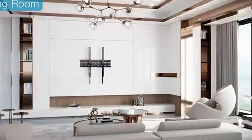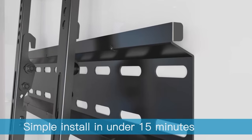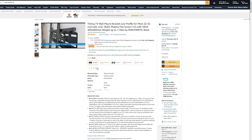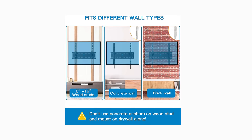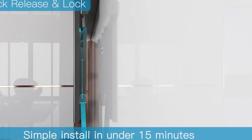You literally just screw the two brackets into the TV with the many sized bolts and screws offered inside the packaging, then slap the 16-inch plate up on the wall with the provided lag bolts and set the TV on top of the wall plate. It even has safety mechanisms to lock it in place and pull tabs to take those off later when needed. For pretty much anything 55 or 65 inches or smaller that you want a nice flat look on the wall, it's a fantastic mount. The only downside is that the mount is exactly 16 inches long, so if your studs don't perfectly align in that distance or you want it centered differently, you may only hit one stud — which is doable using toggle bolts in the top left and right. But some very heavy TVs with that 400mm pattern can stress the ends if you only have a stud in the middle. Overall, this mount is fantastic — it allows your TV to be super tight to the wall and still tilt down.